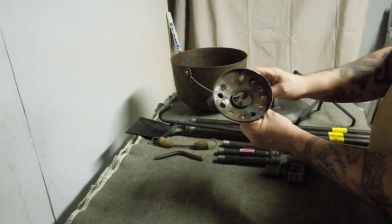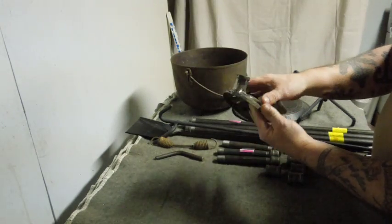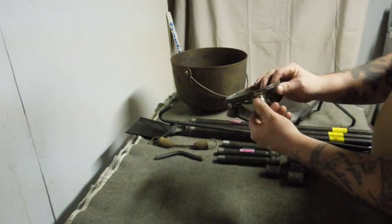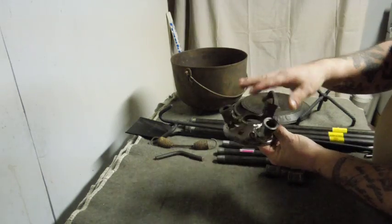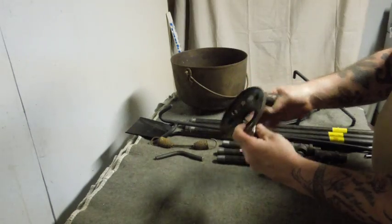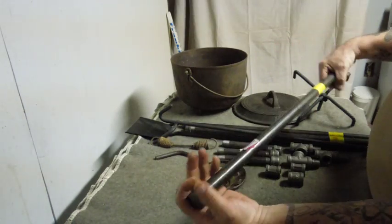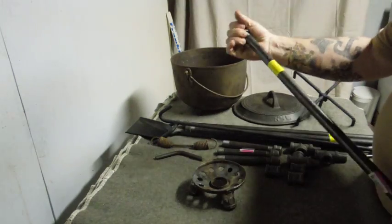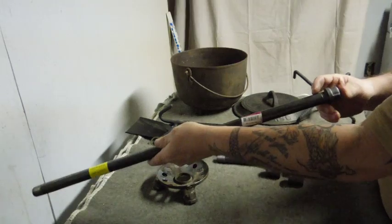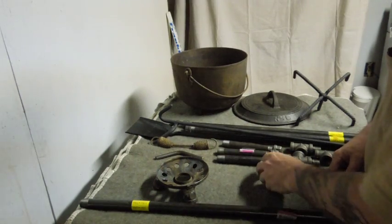I got a base from a large diesel engine oil filter. It's got a real heavy ring on the bottom, and I welded some half-inch black pipe fittings — some union couplers on the end, 120 degrees apart in a tripod shape. This is a two-foot half-inch black pipe. I put caps on each end of all the pipe sections: one so it's got a foot to go onto the ground, and the other to keep it clean and free of bugs, dirt, water, and general crap.